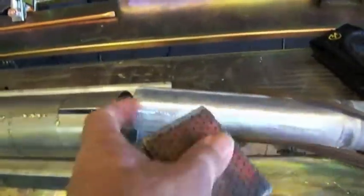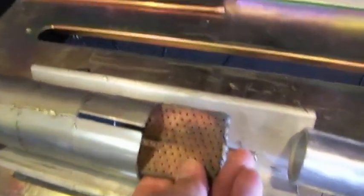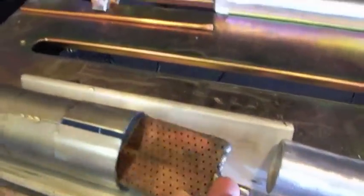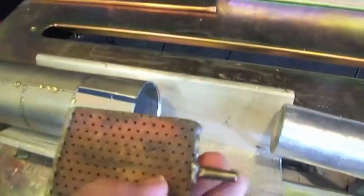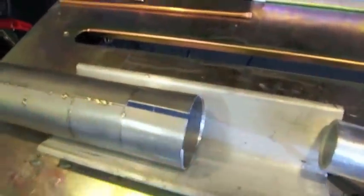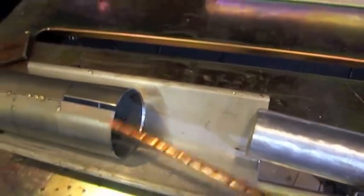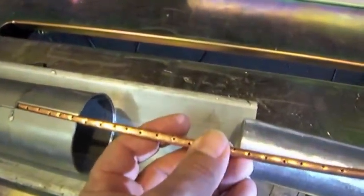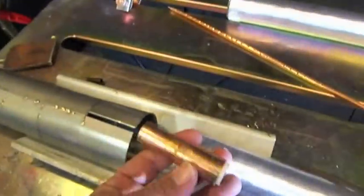You could use something like this — where I come from we call these backup boxes, also called purge boxes. It's just a piece of perforated copper welded on a little stainless steel box with a piece of tube run up in there and some diffuser material like copper wool stuffed inside. But this thing's flat and the inside of the tube here has got a contour on it, so I could stop and make another one — that would take several hours. Another option: I could get a piece of copper tubing, with or without argon holes in it, and just use it for backing to clamp it up in there. That would help, trap argon, and give the metal a place to rest against.